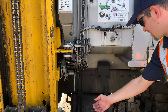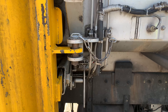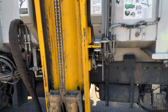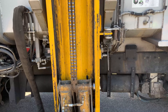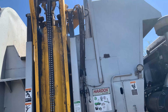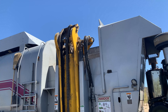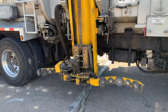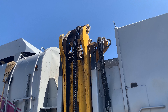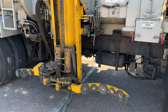There are hooks in the back here that'll keep the arm in. But if those fail, on the off chance, this is just an extra layer of security to keep it from moving. So if you go around a corner, it doesn't fly back. Because if there was an issue with the cylinder that pushes it in and out, this would keep it in there. This is called the N3 arm, and basically what it is, it's a hydraulic driven arm. There are hydraulic cylinders that go up and down behind the rail and they pull up the chain. This arm can pick up more weight in the can — like if someone puts in a can full of dirt, this truck can lift it.